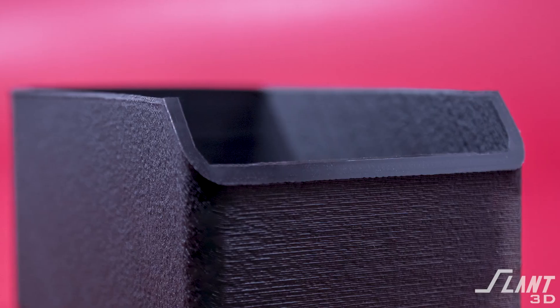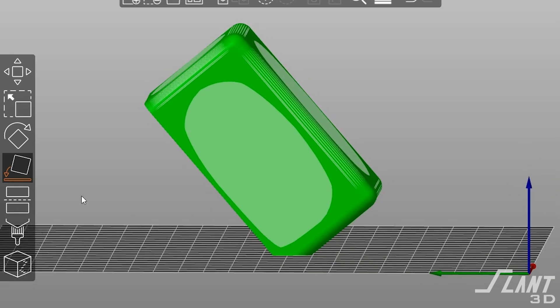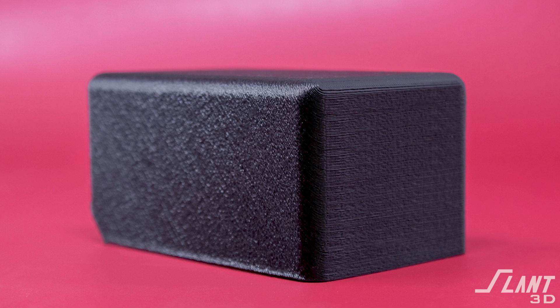You can't normally balance a part at that angle, but you actually can. By redesigning the enclosure so it can be printed belly-down at an angle, you end up with the enclosure just like so — the lid pops off, and you have a flat base on the main core enclosure that allows it to print at that angle. This does require support along the front surface to prevent it from falling, and if the part is really long you'll need quite a bit of support. But overall, the outer surface finish is very, very uniform — every side of the piece matches.